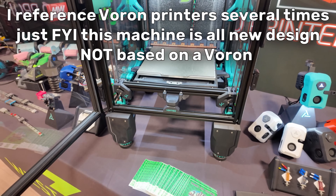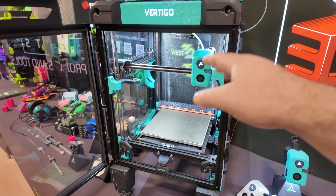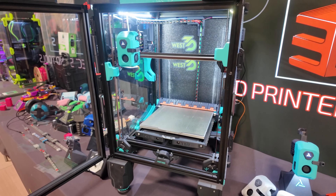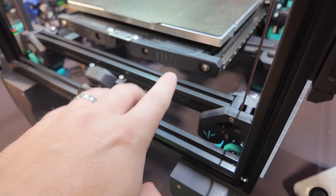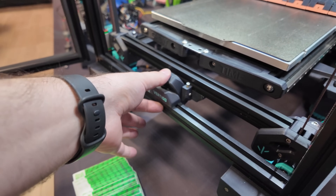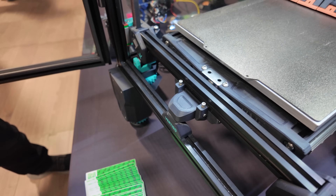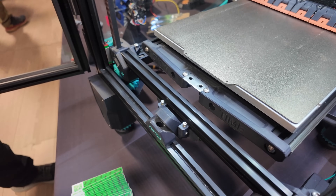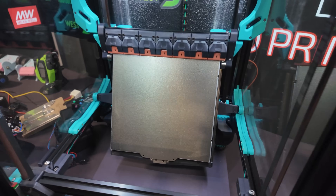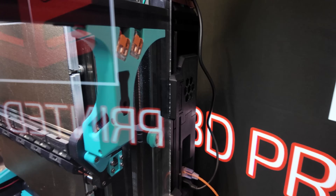Let's watch this again and see it all in action. So it's able to move all four motors up when printing. It has a filament cutter, parking the tool head. It does a homing, holds, then undoes the whole sequence. This drops down below max height, which unlocks the front and brings the tool ball down — so now it's cleared. It picks the bed up. The two rear Z motors basically just pull up, and it pivots on some guides with bearings on the back two kinematic joints.